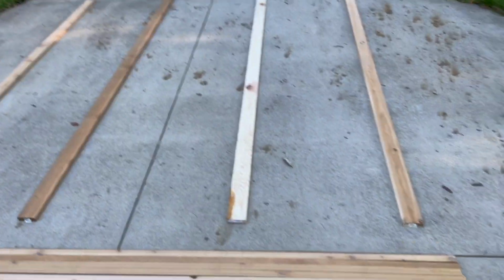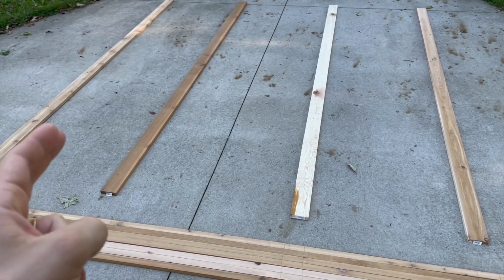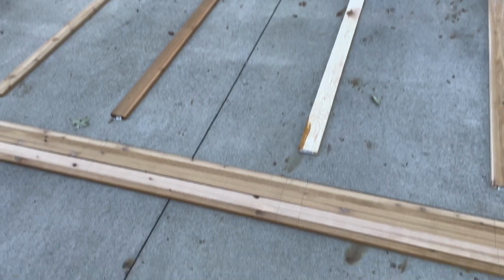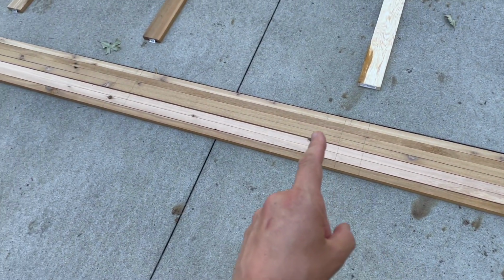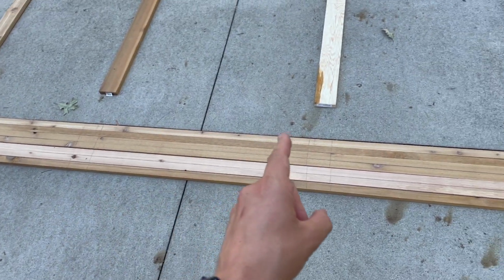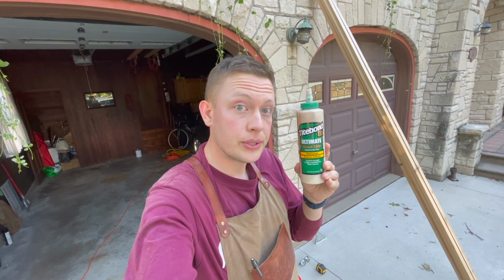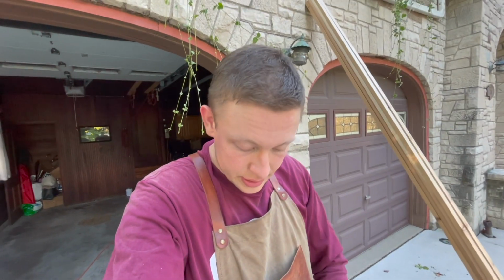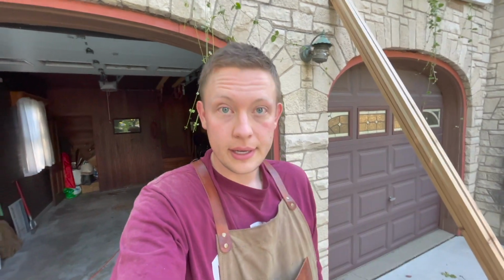Okay, the sun is setting. Let's see how far we can get. We've got our posts laid out, 28 inches between the two ends, 36 in the middle because of where my meter is. Design change. Here we've got the horizontal pieces, all laid out. You can see the marks where these are going to go. I'll line them up there. Every board is going to get glued using 1 1/4 inch stainless steel brown coated nails and a wonderful Fiskars finishing hammer to do the trick.